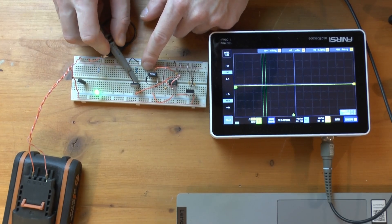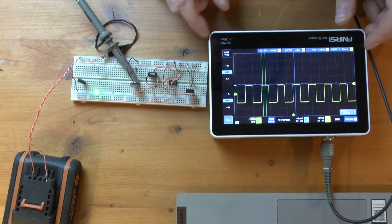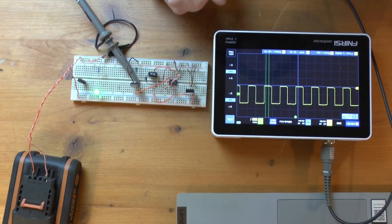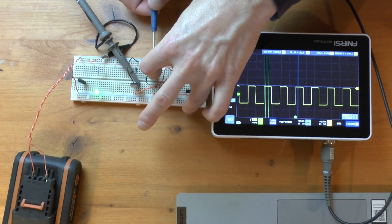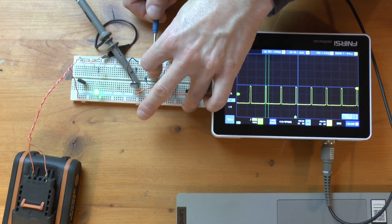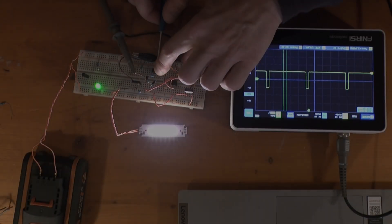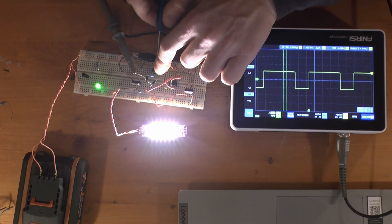It's time to reveal what the product will do. It will have a circuit with a regulator and a power switch. The power switch turns on and off thousands of times per second, so the power delivered to the load will be proportional to the on-time of the switch, which the user can regulate. And the load is... a light!